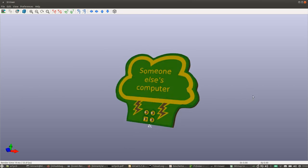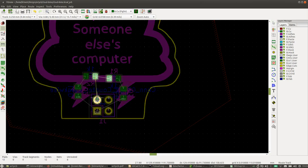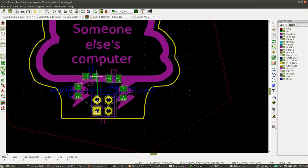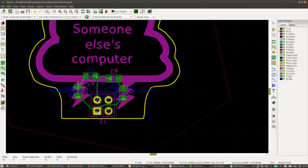So now we're going to connect those together. So we're going to use page down, page up, and page down to switch between top and bottom layers. So we're working on the bottom layer. That's over here as well if you want to do it this way. Bottom layer. And then X for connection. So click where you want to start, click where you want to end, just follow the white lines here. And this is why you don't want white lines crossing, because if you don't have any crossing lines, this is super easy. Okay, there we go. So that's everything connected, that's our electronics bit done.